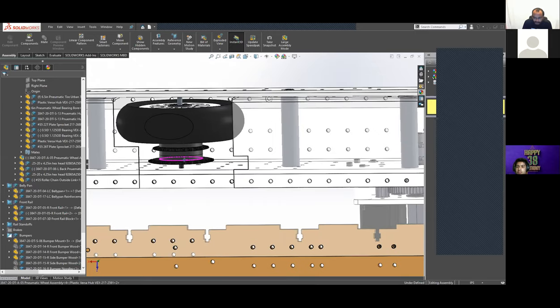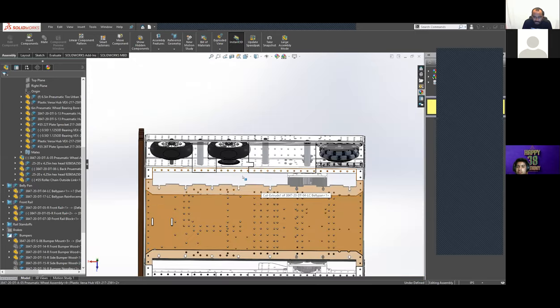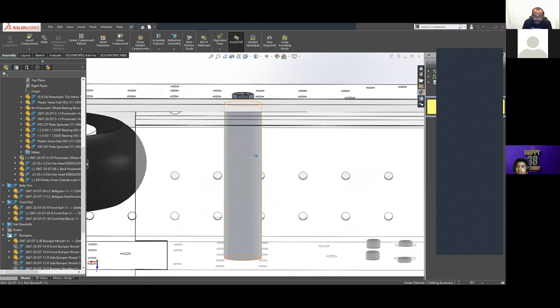Okay, I think that's most of the drivetrain. Oh, yeah, we mentioned we went to 7/8 standoffs. Part of that is just that the bigger the OD of the standoff, the stiffer a plate you can get. You just get more bearing surface compared to the 1/2-inch standoff that we had been using. We had been using tube axle. And this method is also cheaper.